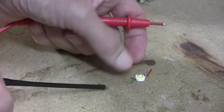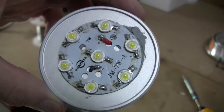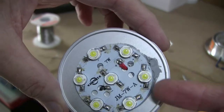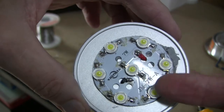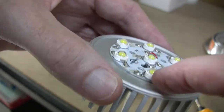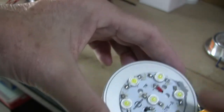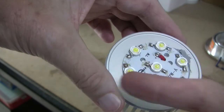I don't know why these actually fail, because they are well heat-sinked as you can see, and there is heat sink compound under this connection panel here. I don't think there is heat sink compound under the actual diodes, but saying that the diodes don't really get that hot because this is seven watts.